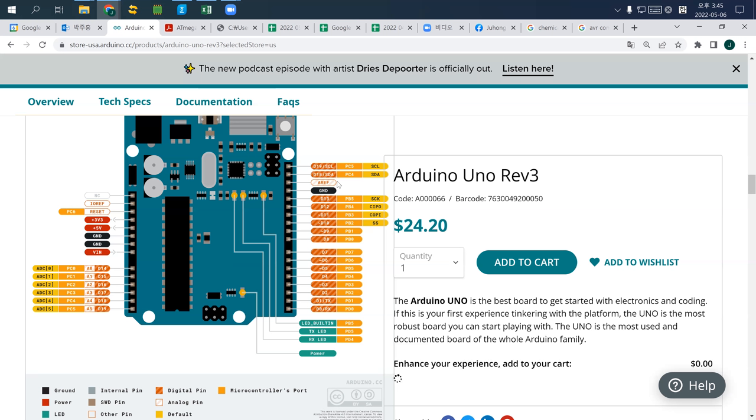So what it means is that the air conditioner is digital output. It looks like there's an analog input control, but it's ignored, it doesn't matter. It simply changes the temperature sensor setting, and it just turns on and off more frequently than before. The same goes for a heater. It has no sophisticated device controlling the heat. It just heats or doesn't heat. If you set your temperature higher, it just has a longer heating time. If you set your temperature lower, it just has a shorter running time. That's it. It just repeats.